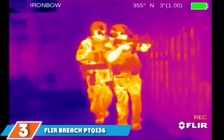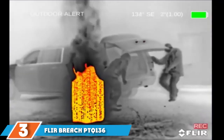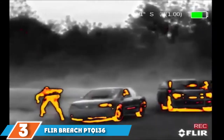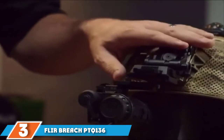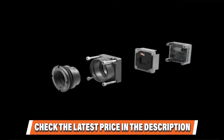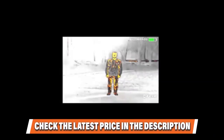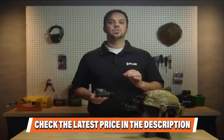The number 3 position is held by the FLIR Breach PTQ136 Multi-Purpose Monocular. The FLIR Breach is designed primarily for law enforcement, but there's no reason you cannot use it for hunting and animal spotting. The integrated railing allows you to mount it on a helmet for hands-free spotting. It has an integrated mini-rail for attaching it to a helmet — no adapter or additional equipment needed. As for the optics, the Breach falls in the mid-level performance range and is better than beginner thermal scopes, but has some significant limitations. The 320x256 sensor delivers a pretty clear image provided you are not too far away. The maximum detection range is about 225 yards for people and large animals, and for smaller animals you need to be about 100 yards away. The Breach has a 1-4x continuous digital zoom, but zooming will reduce image quality.